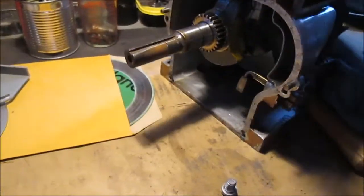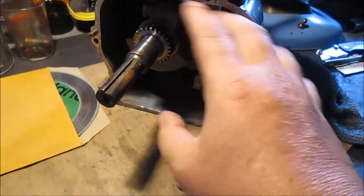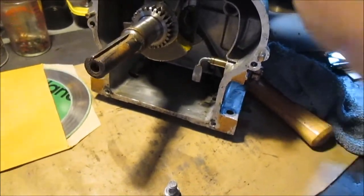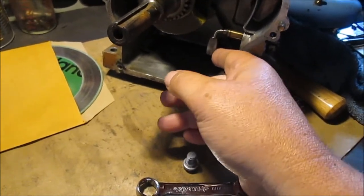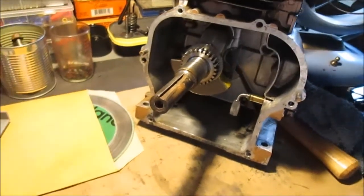It's no big thing to take the side of a motor off — don't be scared. If you do have a governor, I'll snap a couple pictures in case people have never seen one of these big motors. You have a plastic geared governor, and all that is is these weights fly out and move this lever. So I'm doing great detail on that, so stay tuned.